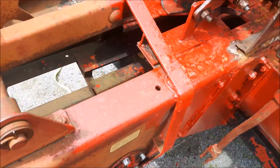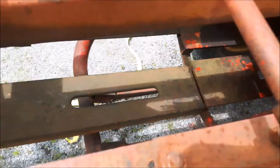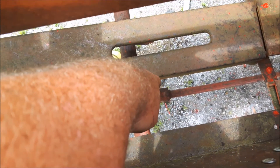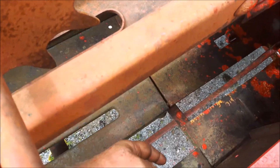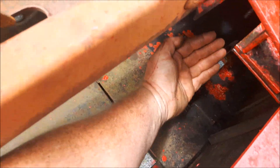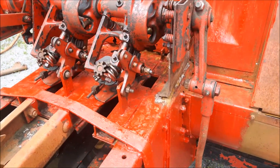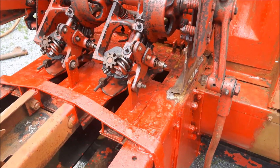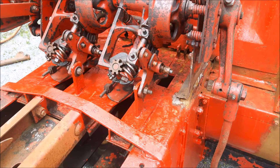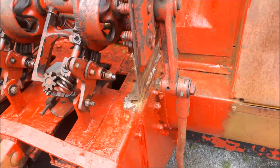So the yoke part with the bearing in here - this stuff is all bolted in the exact same place. Where your needle bolted on was also the half inch out. So when it was trying to go up it was rubbing on the side and then pushing the needle off, so your needle was ending up way over there. You're gonna have that kind of stuff happen, but it can be done - it's not the end of the world. As long as you've got the right number of teeth on your sprocket, everything times up the same and it's got to work.